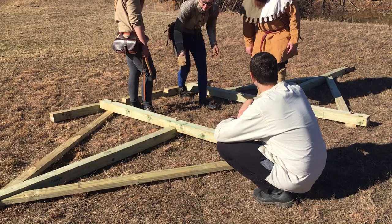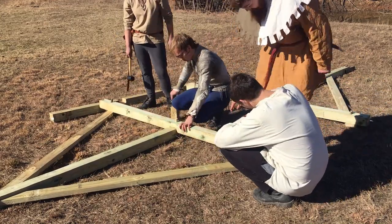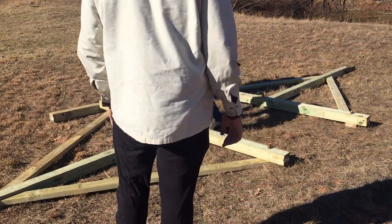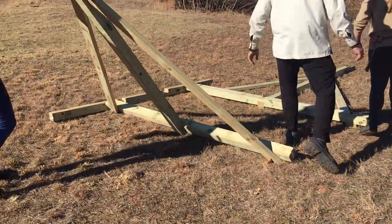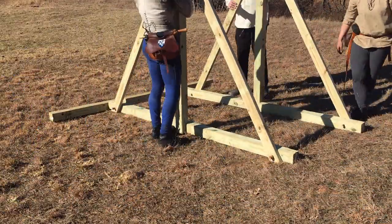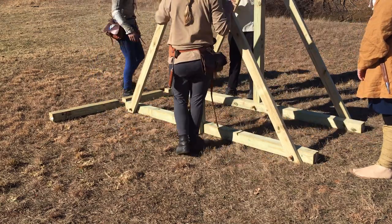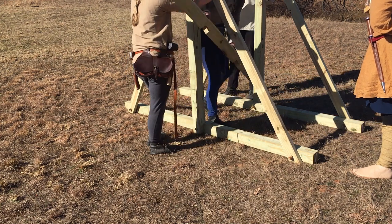But a lot of advantages over nails is that they don't bend. They're not going to be pulled out. They're a lot stronger than nails, except they can be pulled out front ways and back ways. They just resist being pulled apart across the grain of the peg. You can obviously hammer the peg back out, or sometimes if they're not tight enough, it causes trouble too.